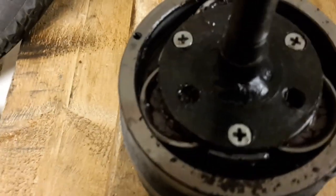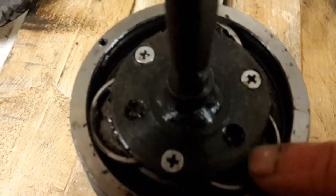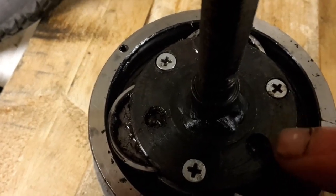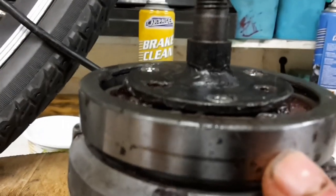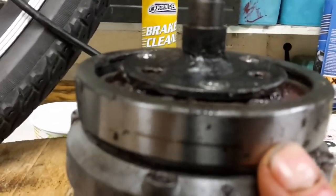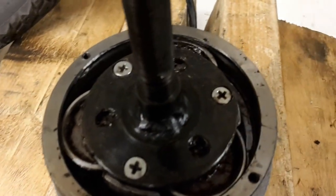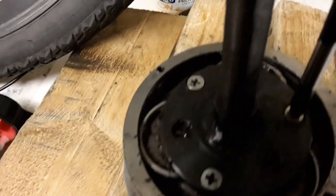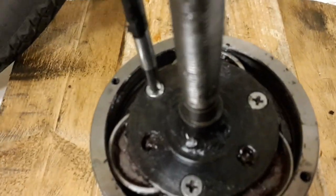So I've fitted the outer plate but I've left the washers out because the pins are coming through and they interfere with the plate. With the washer in between they hold all these little bearing pins in. Now this is still a little bit offset — getting this on is not easy, it's all interference fit so it was tapped on with a mallet. Without putting the pins in they could go everywhere, so I'm not going to do that. What I'm going to do is run the motor, rotate this, and just keep this under a little bit of tension.